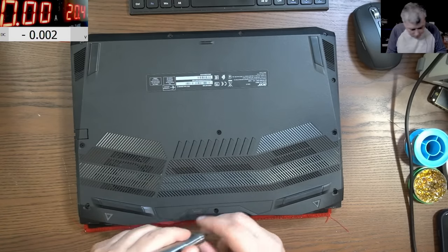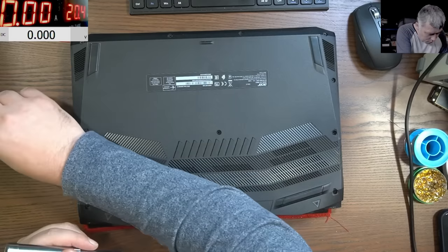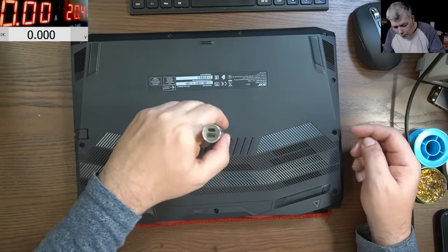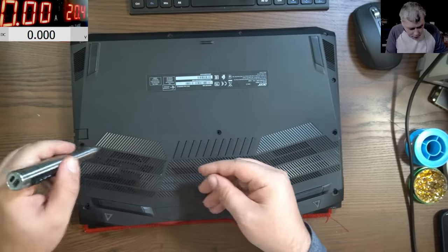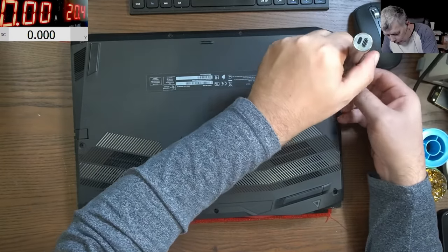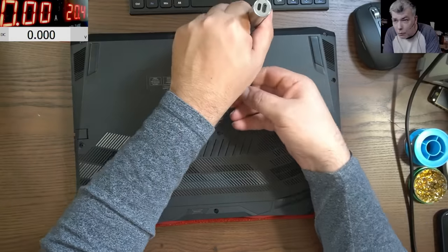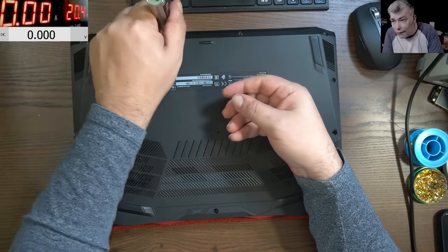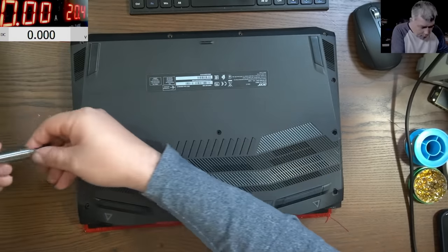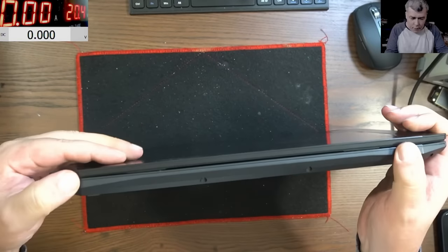What can be done here? I mean, it's no sign of life. No charging. So can be 19 volts power rail missing, can be 3.3 volts power rail missing, can be both missing or shorted at the same time. Okay, so we are focusing on restoring those power rails, or at least find out why they are not present. It's simple till here, yeah? Okay, that's good. Let's assume you're a beginner, yeah?